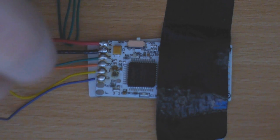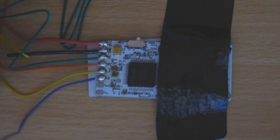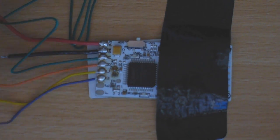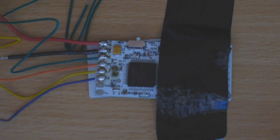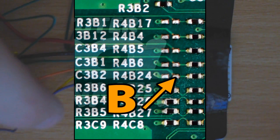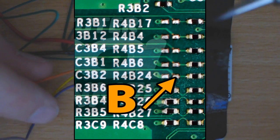Now, another thing I'm going to do, this is just me, is I'm going to get rid of this orange wire, which is the point I really hate, and it's the CLK point, which is soldered right next to a resistor on this tiny pad that often doesn't even have any solder on it to begin with, and it's covered sometimes, and you can't even put solder on it sometimes. It's really awkward. You have to do it on the resistor next to it.